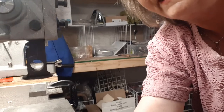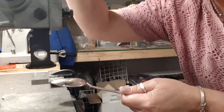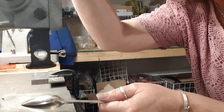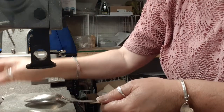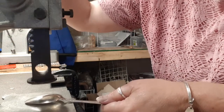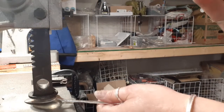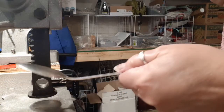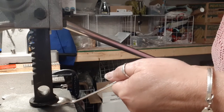Hopefully you can see it — it's just like a little disc on the very tip. I've got a bench block mounted and this system is from Flat Wearable Artisan Jewelry, Suzanne Angle, in the US. I'm in Canada so keep in mind the exchange rate and duty. I have an extension on my arbor press — it's just a regular arbor press; I got mine from Busy Bee but you can get them from Harbor Freight. I'm going to lower my ram and just give it a little bit of a kiss — not pushing it all the way down. If you flatten it directly down you may end up with kinks, which you can work out but it's more of a pain.